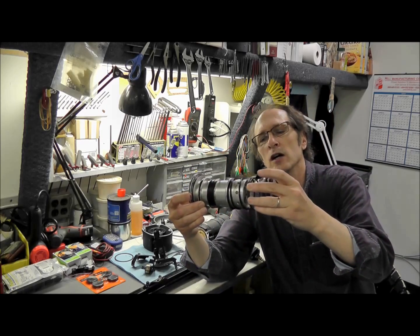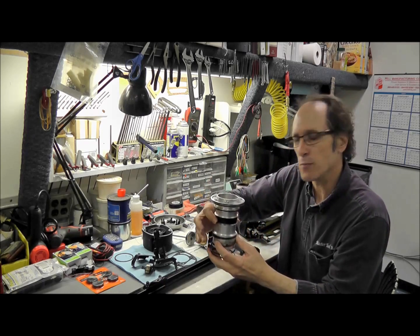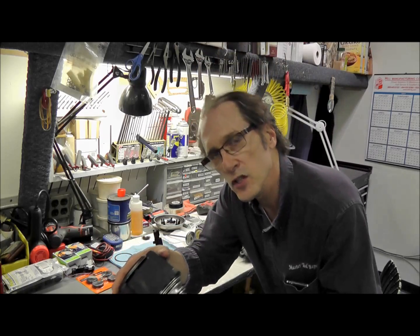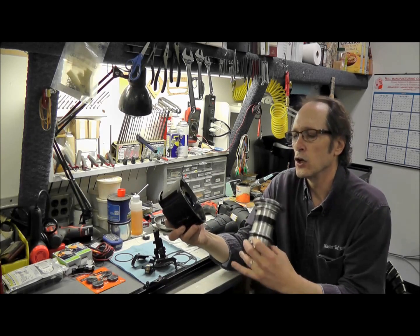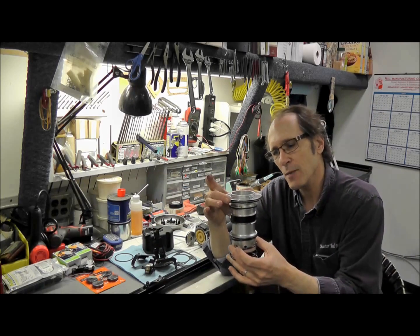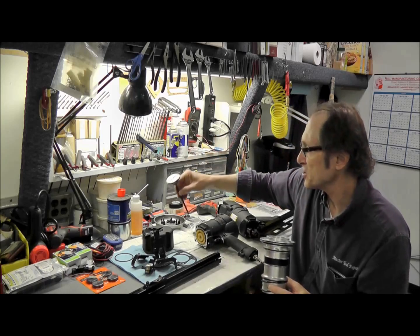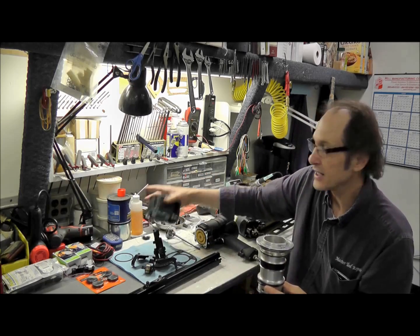As you can see in the bottom of this, there's a big spring. What happens is there is air pressure that keeps this pushed up to the very cap. This rubber piece right here seats on there and seals the air from going inside. But when you depress the trigger, the air surrounding the cylinder drops off, and that air goes through these two little ports on the side, causing an increase of air pressure on the top. This actually slides down so that the air can go inside. Once the air goes inside, it pushes the piston and the driver blade down, catches the nail and runs it into your piece of wood. Then after it's done that cycle, it comes back up and seals again against the cap.